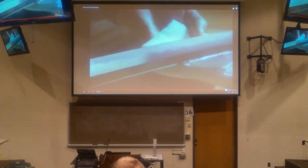This is what I was talking about earlier. This is a hamon. This part is really fine because it cools fast when you quench it. And this is the steel that cools slower. So it's interesting that you can see this difference. So that's really, really hard steel, and this is the softer steel that would prevent it from actually breaking.